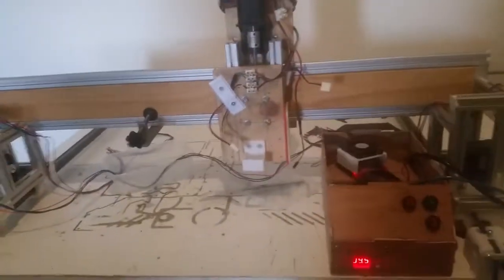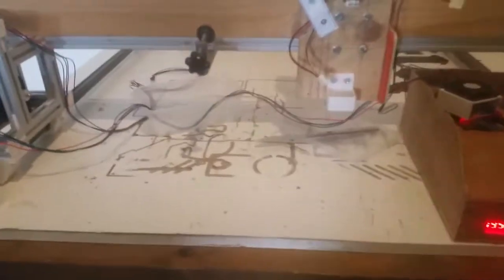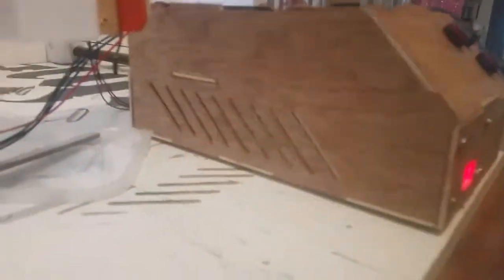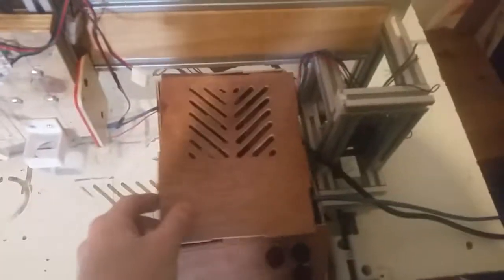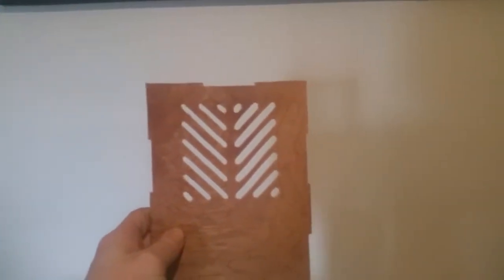So I was obviously losing steps due to torque on the router, and rather than keep on testing cutting squares and that, I made this box. So this is what I managed to achieve, with it mounted with a router on it. There is a lid which is there, but then you will also see the problems I did have as I was tweaking. See, the left grooves are a lot thinner than the right grooves.